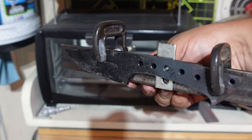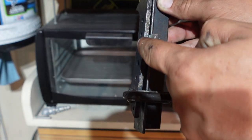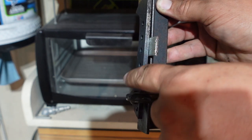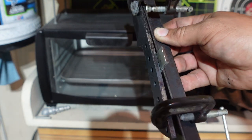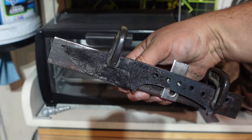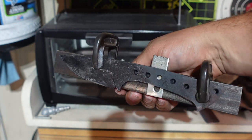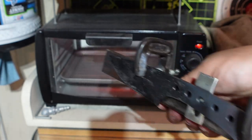So we've got it in our straightening jig right here. We did pick up just a little bit of a warp — the tang kind of kicked out just a little bit — so we've got it straightened out. We're going to go ahead and put it in the oven at about 375 degrees for just over an hour. That's what we're going to go ahead and do to get this done.